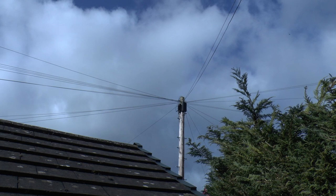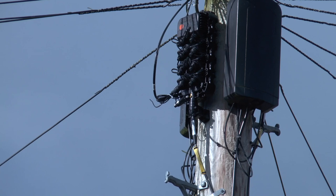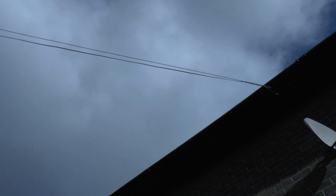Here's the pole feed to my house and you can see that in addition to the copper junction box on the front of the pole, we've got fibre junction boxes on either side, and there's a single fibre connection on there. That's mine, and it's connected along with my existing copper telephone service over to the house. Unlike earlier fibre to the premises offerings, there's no splice box — the fibre goes straight into the house and they were able to present it exactly where I wanted. None of this has to be ground floor against an outside wall — it's actually in a first floor cupboard.